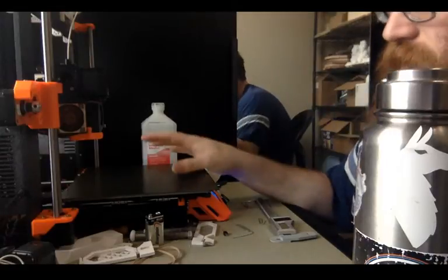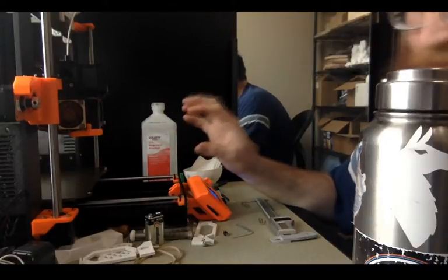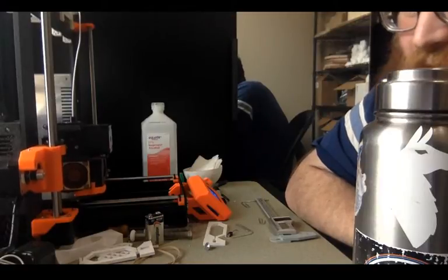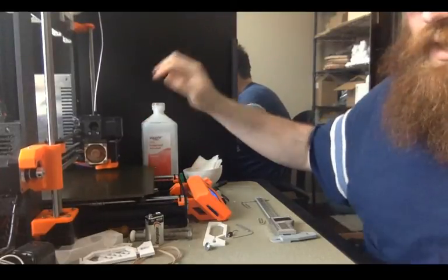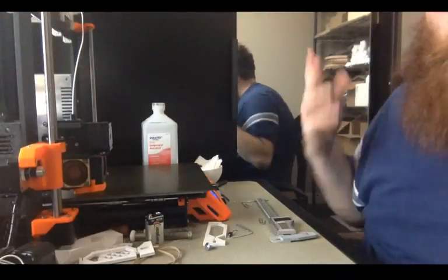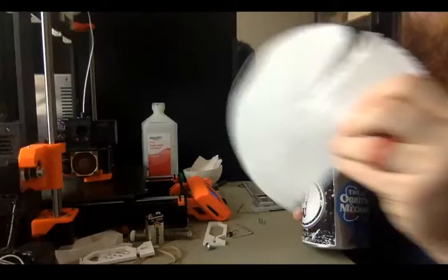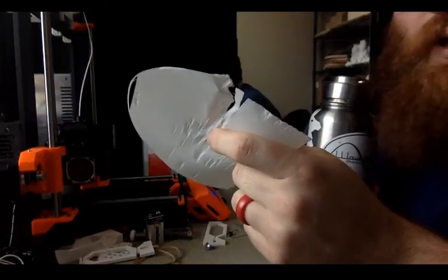I believe what's happening is the print leaves, you know, atomic layers of PLA, and eventually it gets coated, and you need to pull all that PLA off. I don't know. PLA sticks to PLA pretty well, so maybe that's not the case. But anyway, wipe it down with isopropyl every time, and then every once in a while use acetone. About once a week, when it'll stop sticking. You have a failed print, and then you go, okay, time for acetone. That's what this big sheet is. Getting the entire bed to be very sticky is difficult, so I had to wipe it down a couple of times.